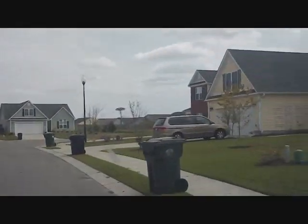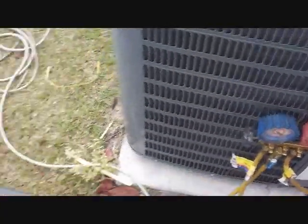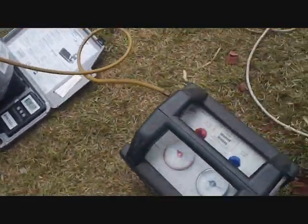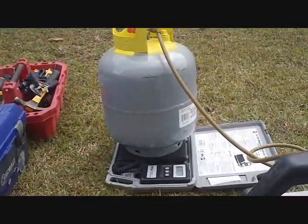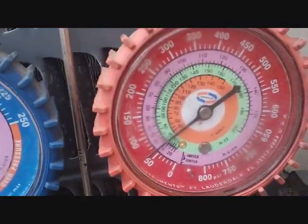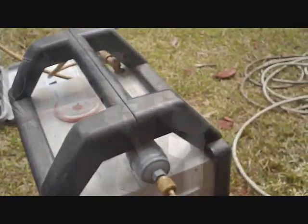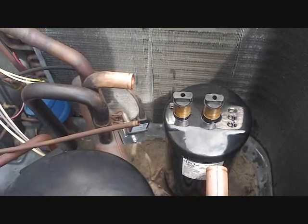Back in suburbia for another day of accumulator changeouts — we'll get down to business. Now we're recovering the gas out of this big Goodman unit. Put in my new drum — it's a nice carrier enterprise running a special where you get your reclaimed tanks for free, so I went in and grabbed one as fast as I could. I don't know how long they're going to do that, but that was awesome. She's pulling down on the liquid side; we'll open up the other valve in a minute. We've recovered all the gas. I have the old accumulator disconnected and we're about to fit the new one up, then we'll flow nitrogen while we braze.